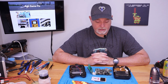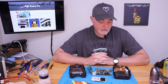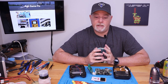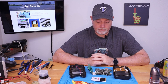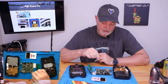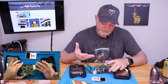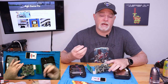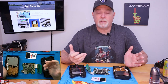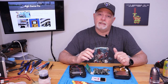This one came to us in bad shape. These, just like the Sega Game Gears and Nomads and a few of the others, suffer from bad capacitors. Basically all the electrolytic capacitors on the board will leak. That material that comes out of them is corrosive — it causes board damage. Some of them that weren't played very much can be saved relatively easily.